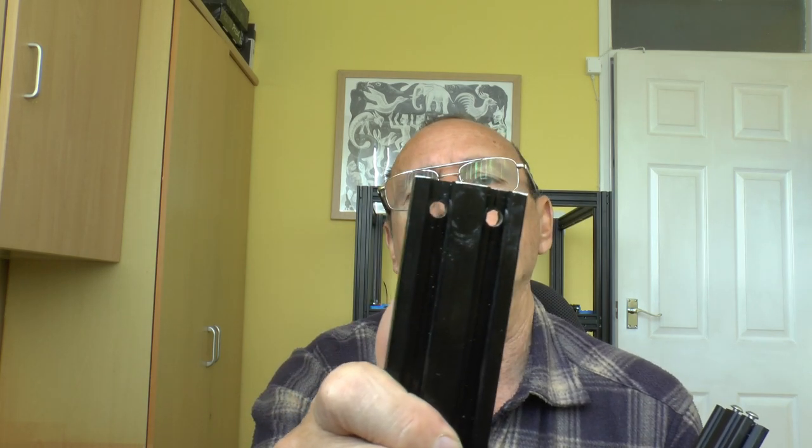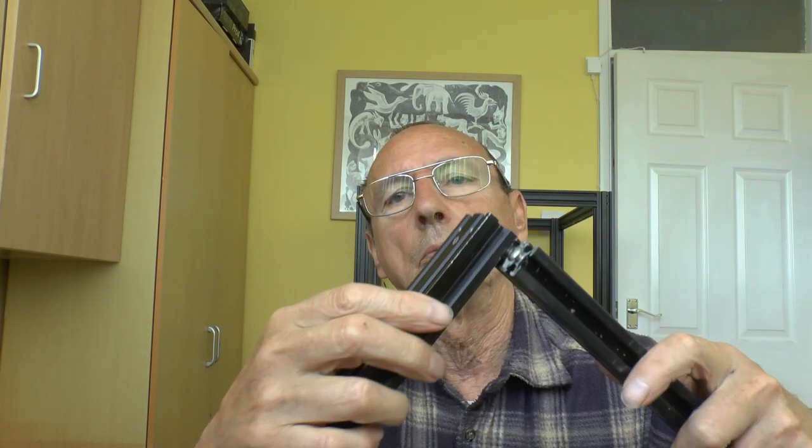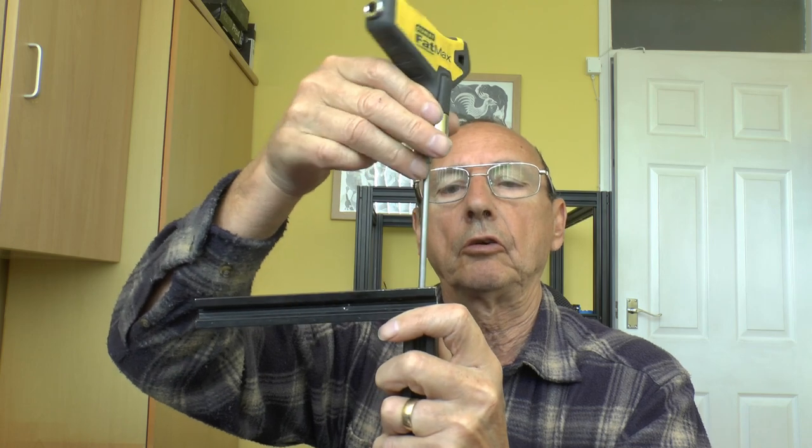So that's basically how it goes together. You have to have access holes in the other piece — put them together, then put a hex key in through the access hole and tighten the screw up. It pulls the head of the screw up against the extrusion, which is basically what holds it together, making a very secure joint.